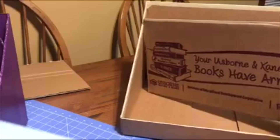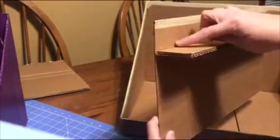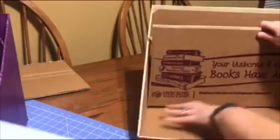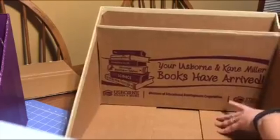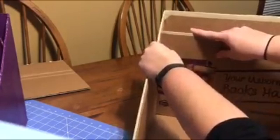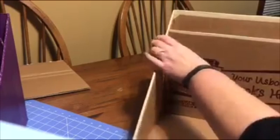This was the piece that goes here — as you can see I glued two inches down and glued that two and a quarter inch piece on. Now I'm going to put it in here. You want to make this corner flush with the side of the box on both sides, so just push it in there as best you can. Then you're going to go ahead and glue across the back so that it attaches to your base.